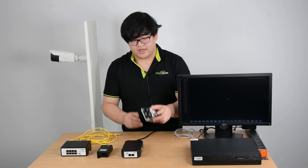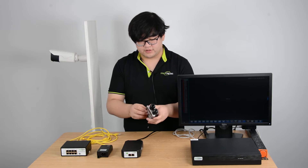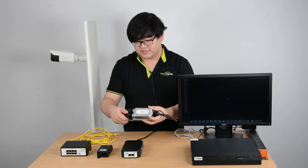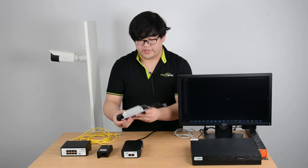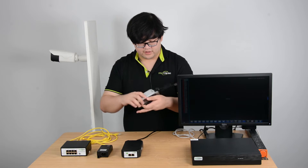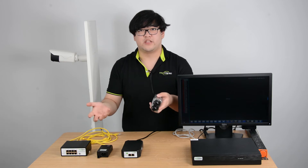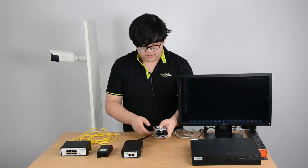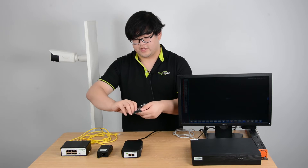This one right here has a more unique outer casing. The coat is metal and this is our outdoor model. This one is waterproof — you can see the knobs over here; these are for sealing it tight to prevent water from going in. Also, the power input here is limited to 24 to 56 volts, so it's still safe outdoors in the rain, since if the voltage is too high there might be accidents. You also have to install a unique waterproof plug when you use it.